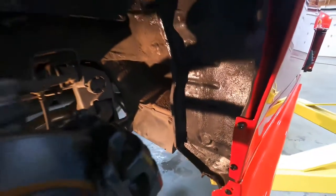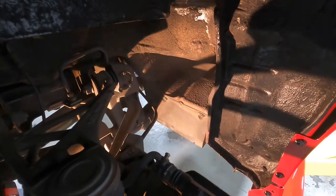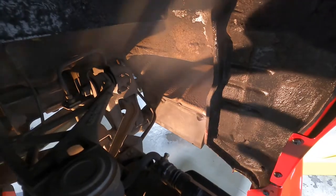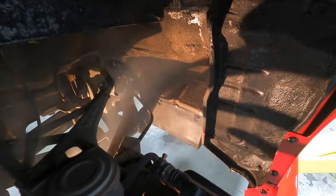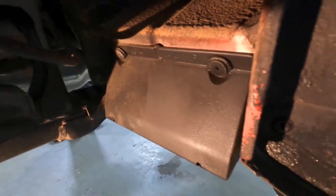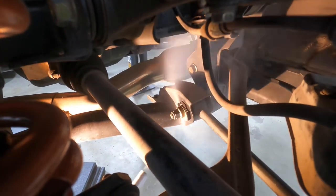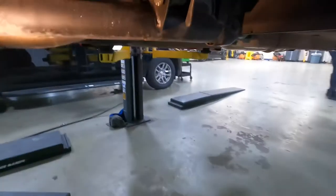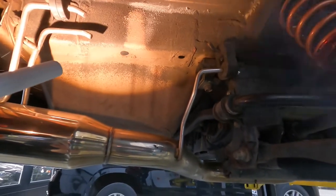Let's demonstrate. We have the Honda S2000 here lifted and we'll work on the undercarriage. It can clean any material under here — from metal to plastic to aluminum. It will blast off undercoating, any leaks that have bonded with dirt and hardened, creating a nasty shell on your undercarriage parts. The dry ice freezes the contaminant, and then any pass after that first pass will blast off the frozen particles and safely clean the material.